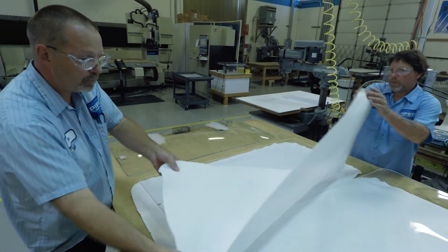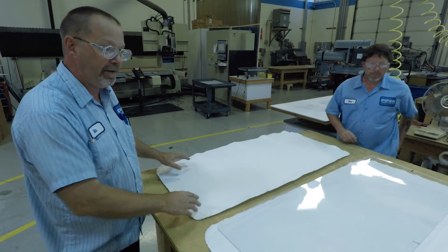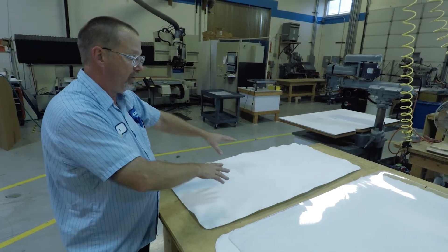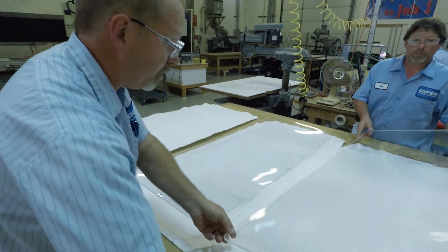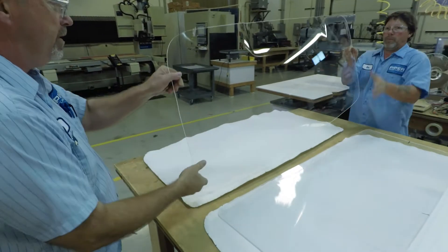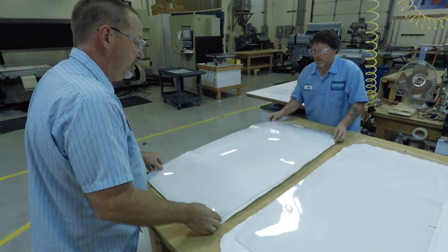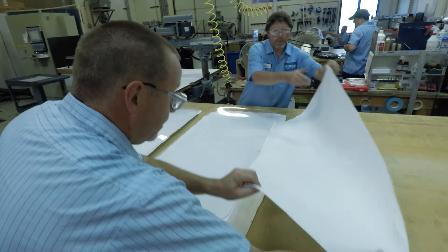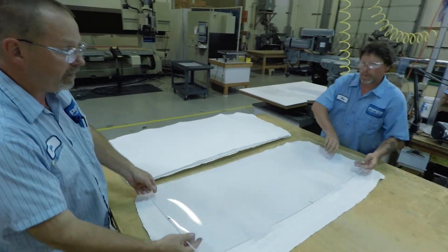When you're molding acrylic, you've got to protect everything. This is kind of the same thing we would have done. We would have had our lower mold, warmed up the acrylic, pulled it out of the oven — it would have been all oversized. We set that in place, center it, felt it for even heat distribution.